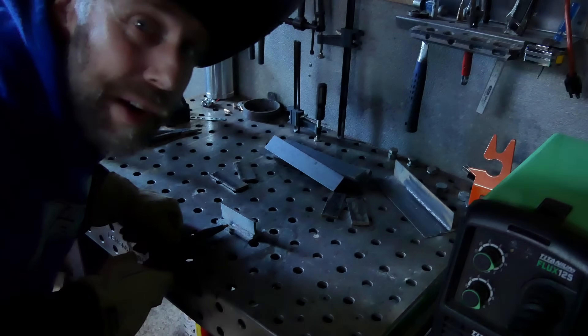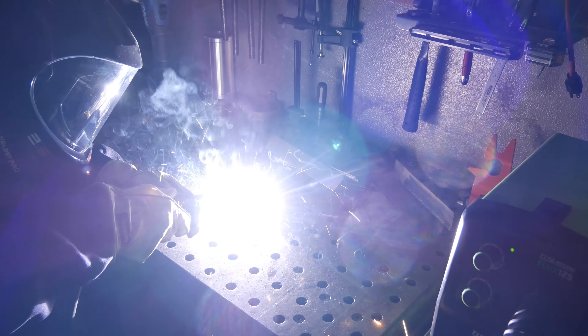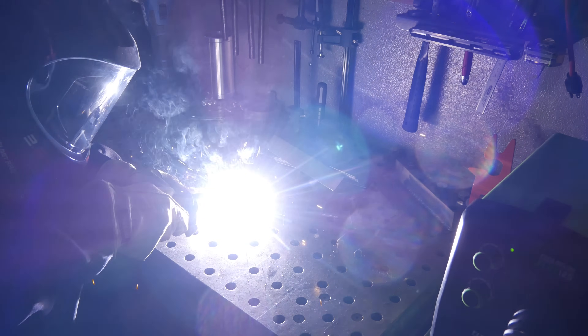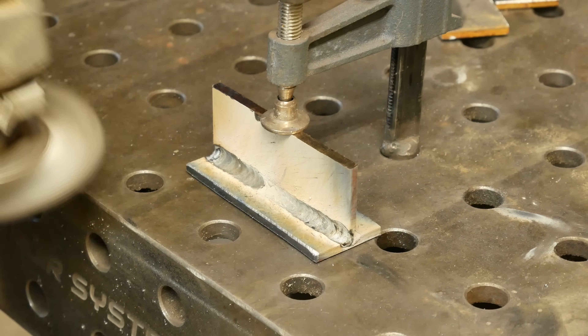There goes the breaker. Because I don't have a 100% dedicated breaker for this welder, I popped my breaker pushing at almost the full amps. I turned off some lights that were actually drawn on the same breaker to free up a few amps there, and it finished off the weld no problem.